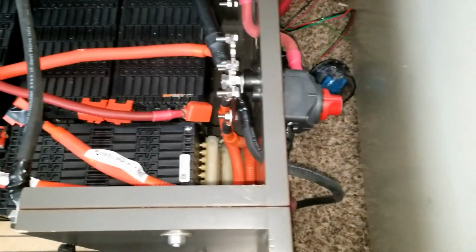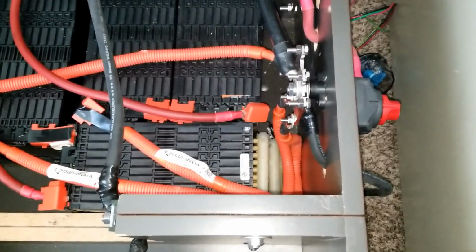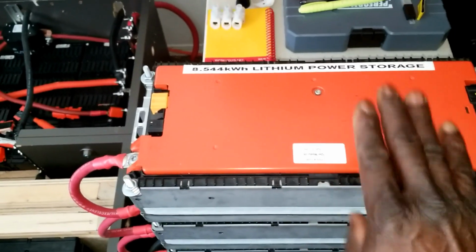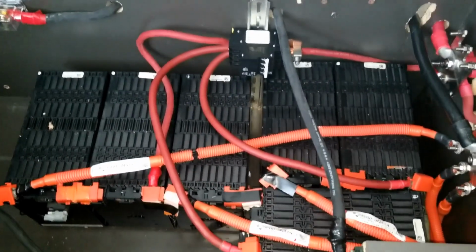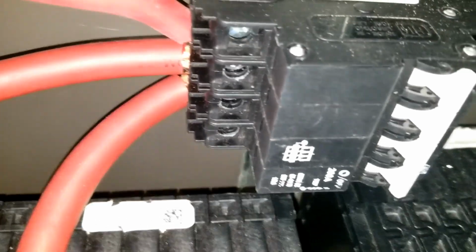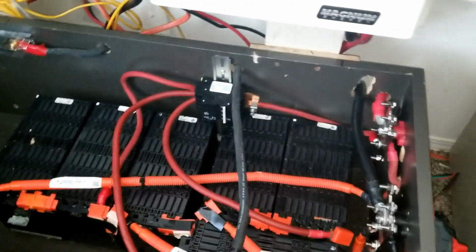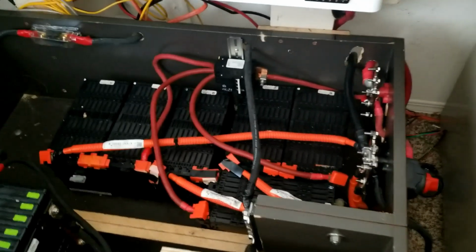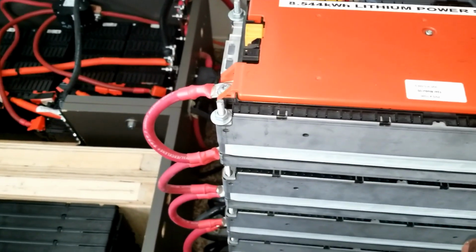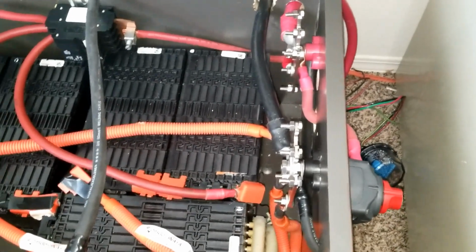So there's a switch on that corner right there. Lightning arrestors are sitting underneath there. So I'm going to do a changeover from here, disconnecting, disengaging this bank to that bank right there. But both of them have breakers. So you can see it's a 200 amp breaker right there. I have three strings there. It can take about four. So you can see the other spot is open. So I can even probably take this bank to that, but I think it's going to overload the circuit breaker. But I want it the way I have it right now, so I am able to do the changeover anytime.